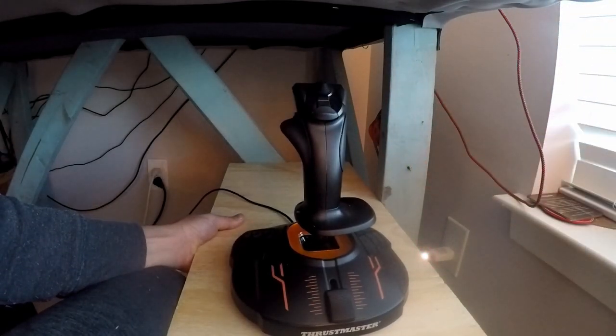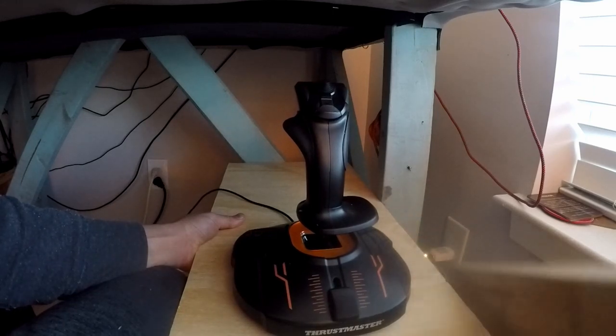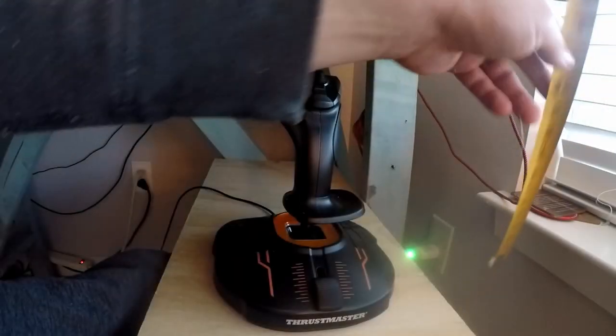I wanna mention here that the distance between the right side of the board and the left side of the board is 1 foot. So you need to be making sure that the top of the desk there to the surface of that board is at least 1 foot. Otherwise, when you flip it up, it won't clear. You won't be able to flip it. So just make sure before installing that you measure twice. I'll start putting the 2x4 underneath here for support, and below here for some support as well. And hopefully that works. Hopefully it's all straight. Okay, let's try it.